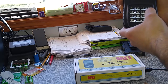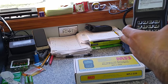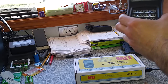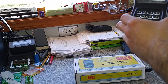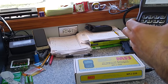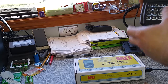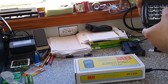Now the calibrate function — you can calibrate it. A lot of times people already know the losses of their feed line. What they'll do is measure it over a couple of days in different temperature and wetness conditions. Once they have an average, you can calibrate it — put in the parameters and factor out the coaxial loss. Then you'll get your SWR plots for your actual elements. I'm the type of person where I want to know how the whole system is working — the whole matching network.